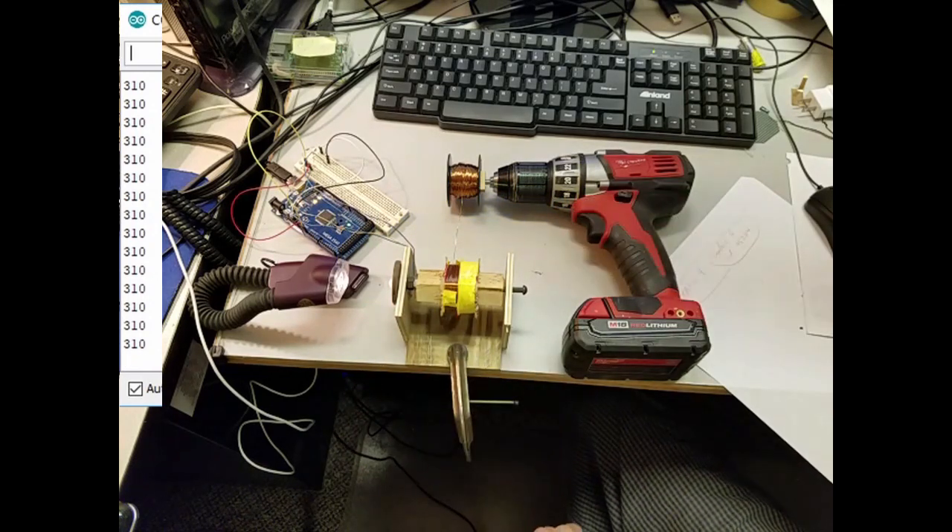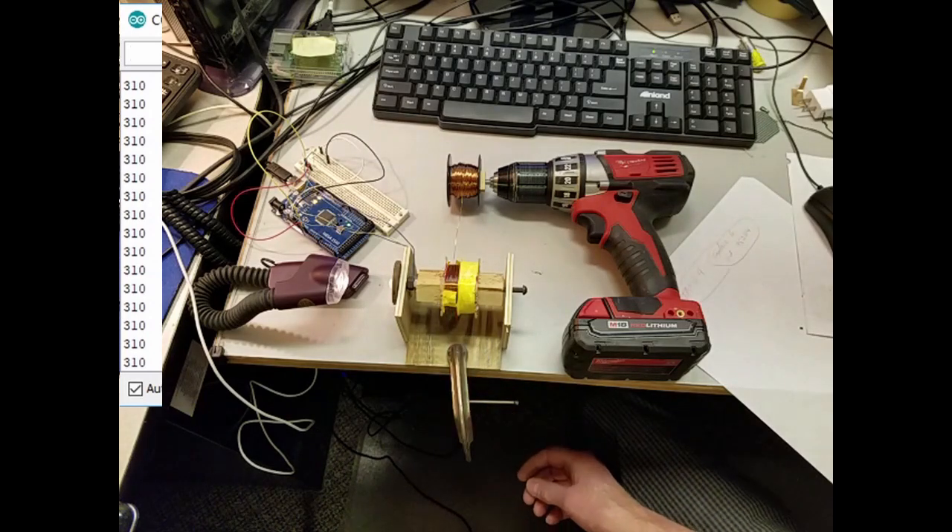I think this has been a very worthwhile project. I have 310 revolutions from the outside in to where I'm going to replace this thermal cutoff. I was able to accurately count the number of turns that I removed from the transformer coil. After I receive a replacement thermal cutoff, I'll be able to rewind the coil with exactly 310 wraps of wire and hopefully get the transformer back in service. Thanks for helping me build this project. If you like this video, please give it a thumbs up; if not, give it a thumbs down. Leave a comment or suggestion for things to do. I hope to do more of these videos, so please subscribe and click on the bell for notifications. Let's get together next time to make more things that I need from the stuff that I've got. See you soon!